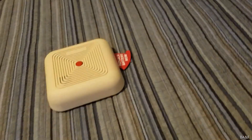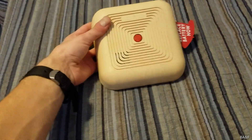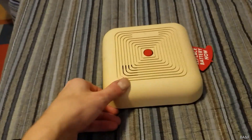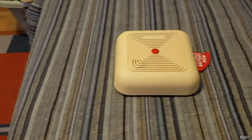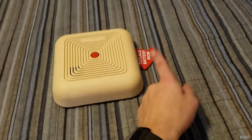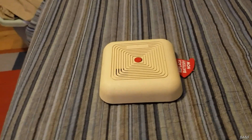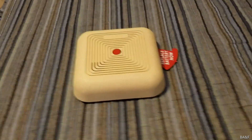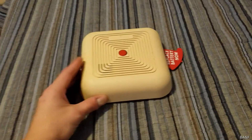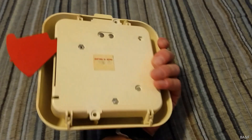As you can see, it's their older square design with the red button in the middle, unlike the newer rectangular smaller design. This one is the older design, and notice right here it has the battery flag. This is actually a 12.6 volt mercury battery model — it takes the Mallory 304116 mercury battery. That flag only the 12.6 volt models had; the 120 volt models didn't have it obviously because they didn't have a battery. When they switched to the 9 volt models they got rid of the battery flag, so that battery flag is a good indicator of whether you have a 12.6 volt model.